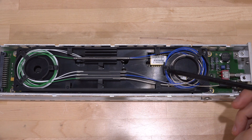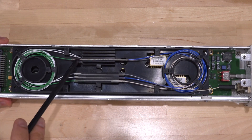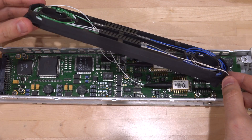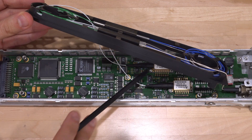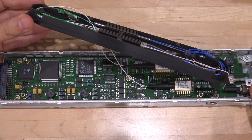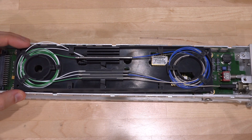These Fabry-Perot laser modules internally have feedback loops, and they even have TECs to stabilize them and measure output power — there's a lot of analog loops running underneath. You can even see the FPGA right through here. If I remove the top layer, you can see underneath the two lasers. You can see the same platform in the back — they're reusing it over and over. There are again DACs and ADCs to power these modules, sitting on a thermal pad at the bottom because there's a TEC inside to keep them temperature-stable. It even has the same switch, which is the laser enable switch. They really are reusing many things. Now I can close it back and put it in the instrument to do some fun measurements.